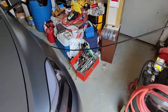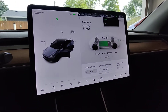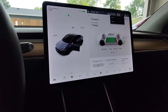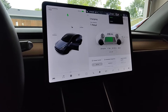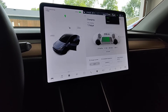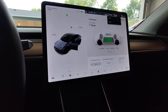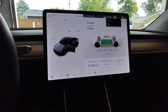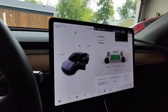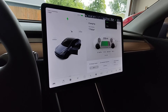This is a feature that is in a software version for these chargers that your charger will not automatically download — you have to manually go in and update the firmware on both chargers. Once you've done that, you have to set one of them as the master and then add the other chargers to that one. You have to have the Wi-Fi data for both of them, because one charger connects to the other one with Wi-Fi. That way, if you don't have enough power in your garage to fully support 48 amps per charger, you can charge both cars at the same time.